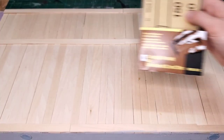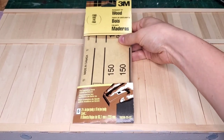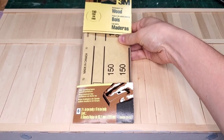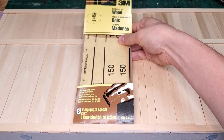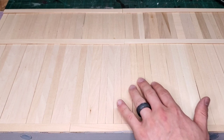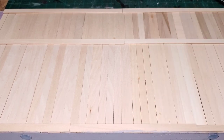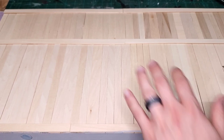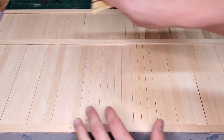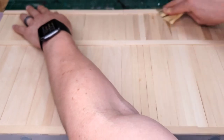I did forget to mention that I am going to be using sandpaper for this. I'm using 150 grit fine sandpaper, and I'm just going to do this lightly to get the wood as smooth as possible. It's already in a pretty good spot, but I want to make sure that it's going to accept the stain as well as possible. I'm going to sand as much as I can in the grain of the wood, and for these beams on the top I'm just going to sand a little bit going across.